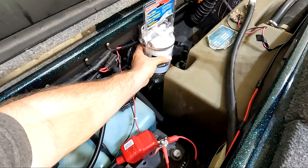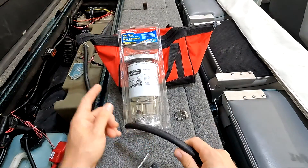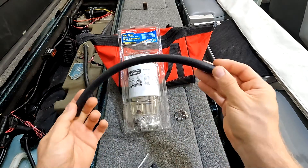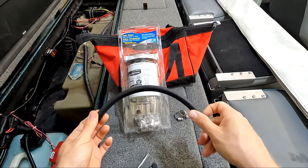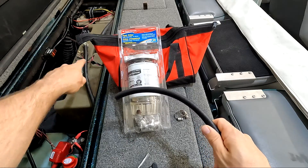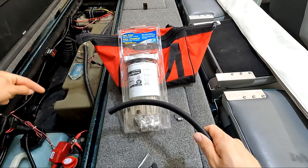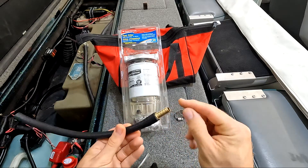It'll keep it out of the way, I'll still have access to the bilge area, and it will be really easy to drain and monitor the water at the bottom. Depending on how much fuel line you already have in your system, you might not need any extra fuel hose. I happen to have this one-foot length of fuel hose that I may use as an extension if needed. I'm trying to install this in line to the current fuel hose, so I need to cut the hose at one point, route it into the filter on one side, have it come back out the other, and then connect back into the fuel system. I also had a three-eighths splice kit already on hand — barbed on each end — if I need to extend the hose.